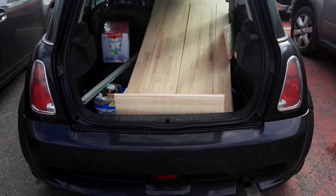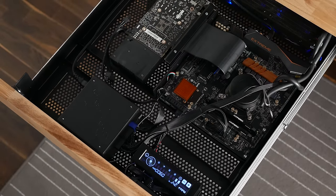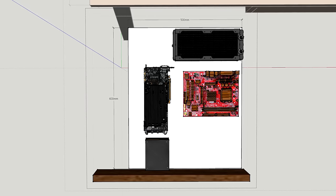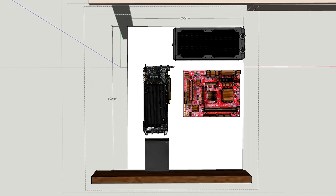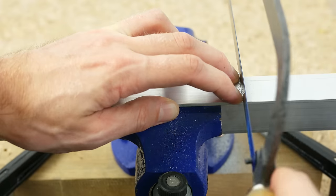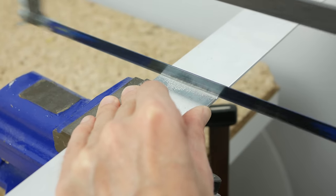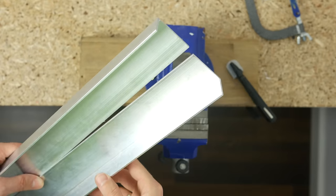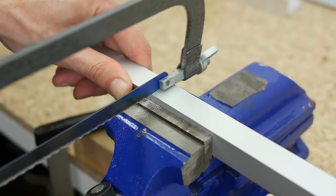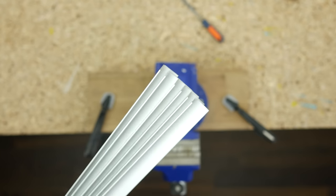First, the PC drawer. I figured that 60 centimeters by 50 centimeters would be enough to accommodate all the hardware and allow for efficient usage of available resources. I cut two 60-centimeter-long pieces of angle aluminum bar, 5 centimeters by 3 centimeters, that would make the left and right sides of the frame. Next I cut some smaller 2 by 2 centimeter angle bars in half to run across the frame as supports for all the components.